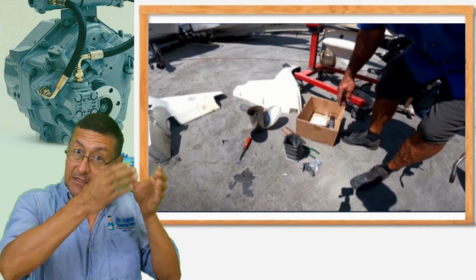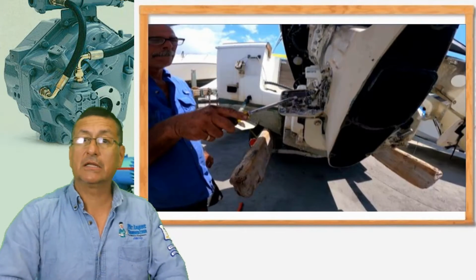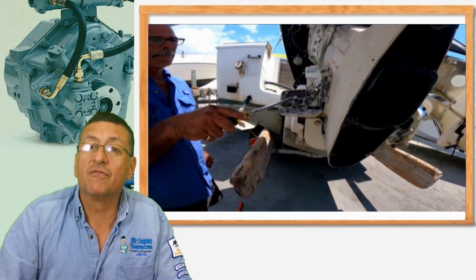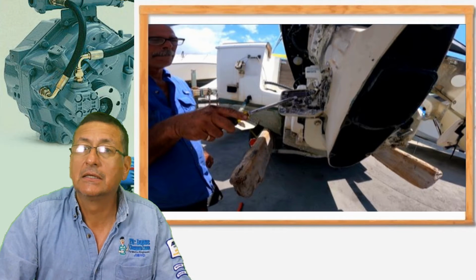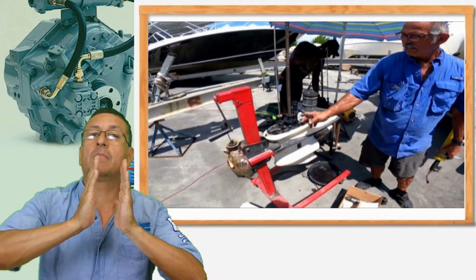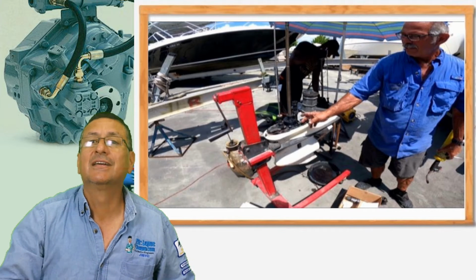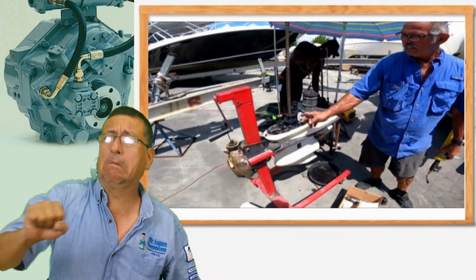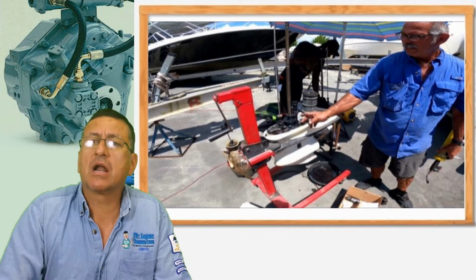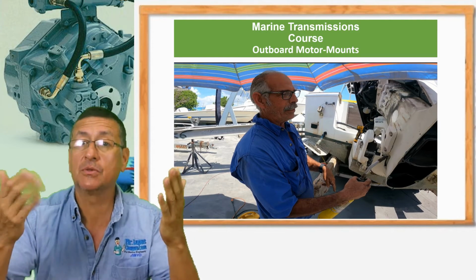Because that tunnel located in the middle section was completely melted, the motor mount located pretty close to the tunnel had its rubber melted, and the metallic part of the motor mount affected the movement of the drive shaft. And the customer complained that it's difficult to engage or disengage forward and reverse. Incredible.